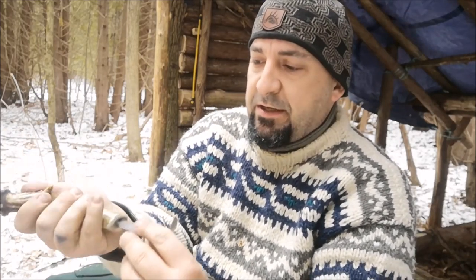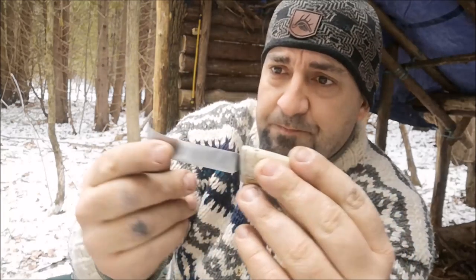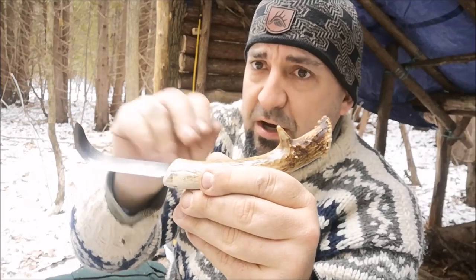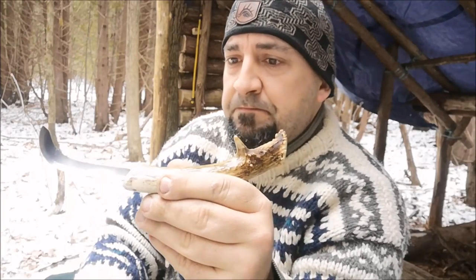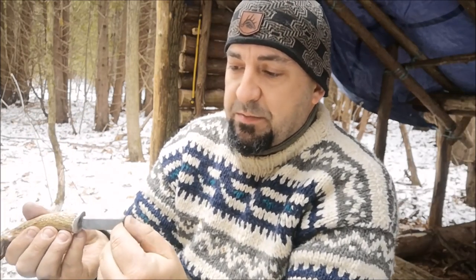I think some people could work it differently, perhaps an overhand grip if you're tired, original underhand grip as it was designed, or turn it away and use it as a carving tool that way. The big idea is that the bottom is flat ground with the bevel on the one top edge, and that lends itself well to that drawing action, that flicking action, carving those shapes, and either removing bark or removing wood to create whatever you're trying to create.